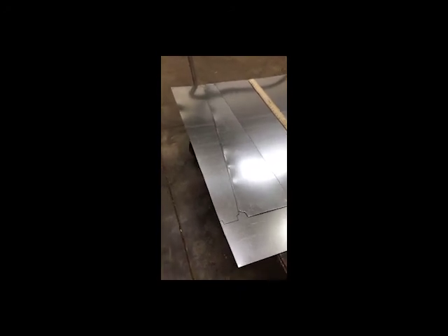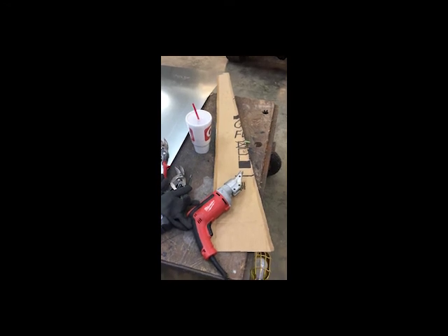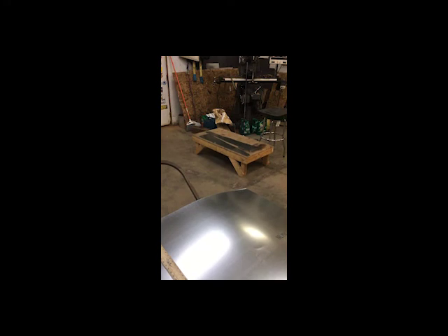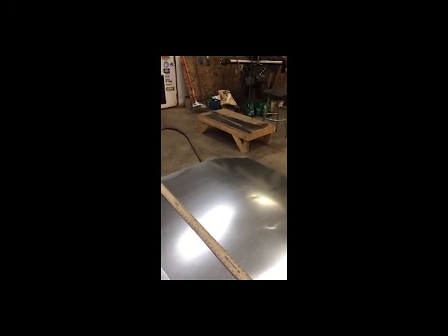Here we are laying out the pattern for the end panels on the Ecolibrium EcoFoot 2 Plus base mounts. Greenwood County wants the ends capped off, so we made a cardboard template to get an idea of what size they need to be. We're using the Milwaukee shear to cut them — we've already cut four on that wooden platform. We test cut one, take it down to the brake in the lower part of the shop, break them, and then use ground clips to clip them onto the underside of the panel and to the wind deflector on the backside.